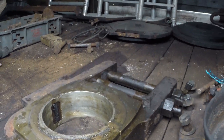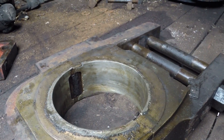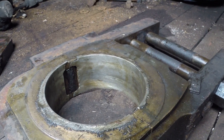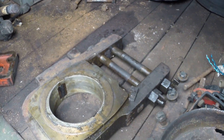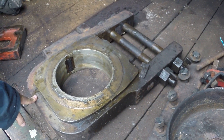The wedge keeps the two big pieces of bronze that actually form the bearing surface together - they're a two-piece design because again we have to wrap around as we can't just shove it on from the side. It's a bit like a modern car engine in that you have a split design, but slightly different. Let's go out to the storage wagon and have a look at the disassembled one. Here we are - I've just brought this out of its little spot in the storage wagon, awaiting inspection and cleaning. We call it the horseshoe because it very much is a horseshoe shape.